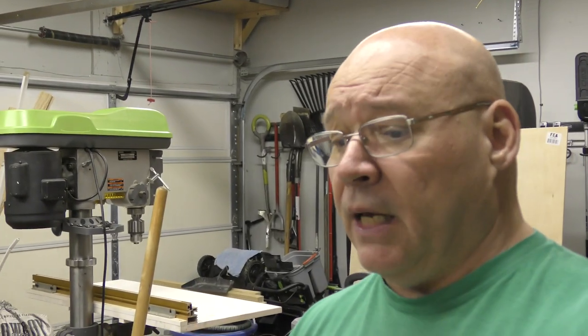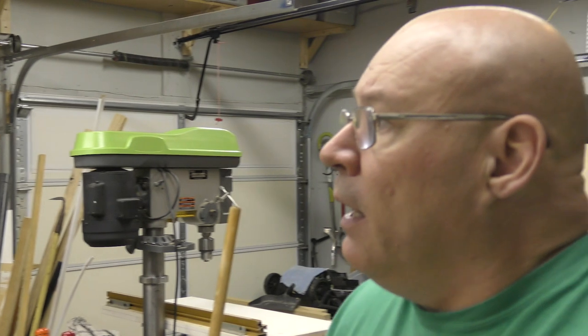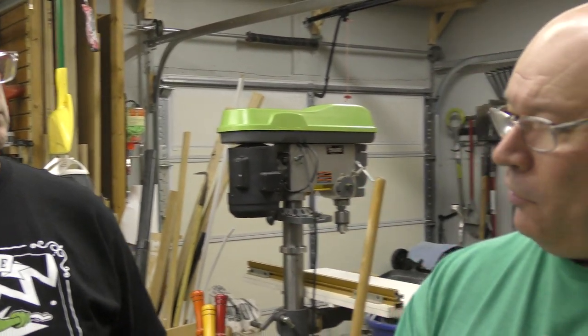Now, as good as you get, a saw mechanic or a table saw mechanic knows how to keep it against that fence, because that's what he's referencing, right? Okay. And if that person does it day in and day out, they get really good at it. But someone like me, I haven't been on a table saw for like 13 years, I wobble on it. So what happens is in the middle of that board, it could be 298 millimeters, it could be 304.